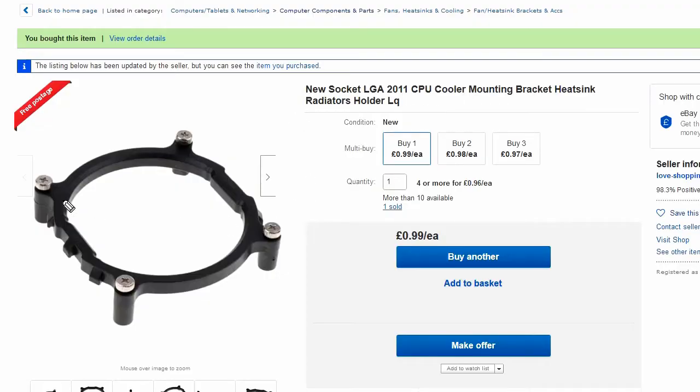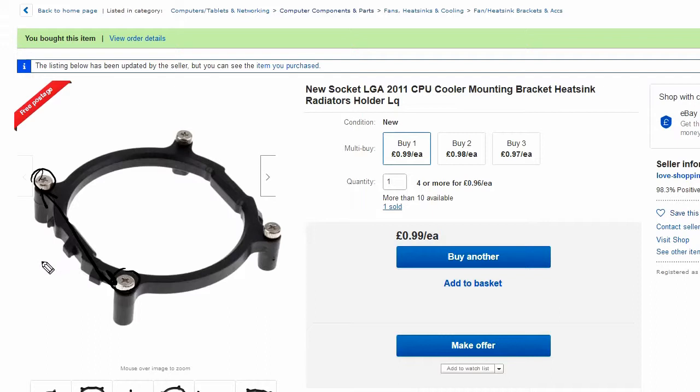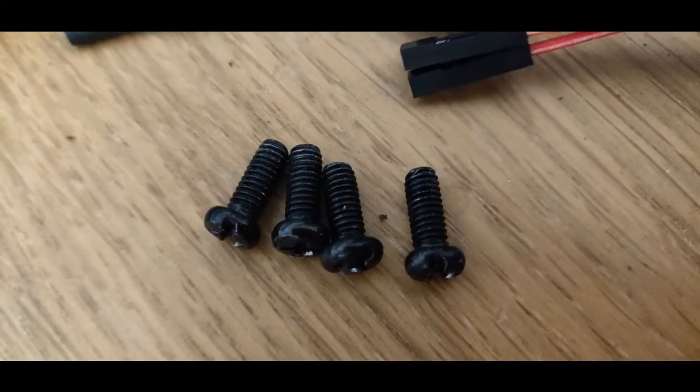There was a different one with spacing between these bolts a bit lower — about 5mm lower. Now LGA2011 has them at exactly 80mm and this is a perfect square, there's not much philosophy here. For this project I used 4 M4 screws with 10mm thread.